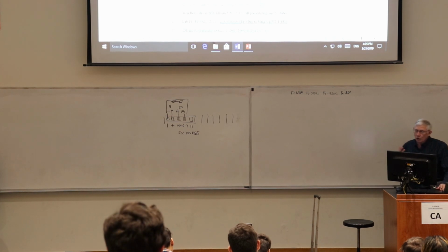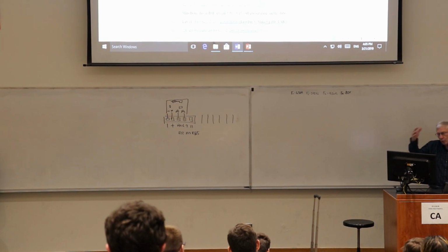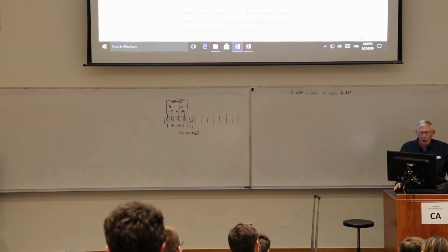As you shine light on and off the photoresistor, you can figure out where a good threshold is, and you can actually set it up so that the photoresistor would turn on an LED or turn off an LED depending on whether it was seeing the light or seeing a shadow. And it's kind of fun to play with that threshold and see how it works.